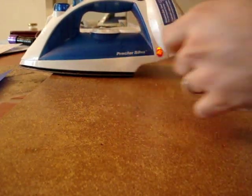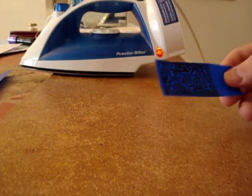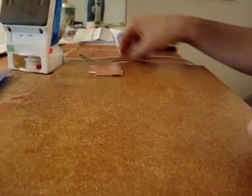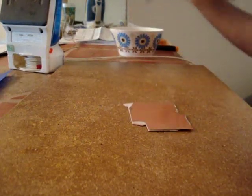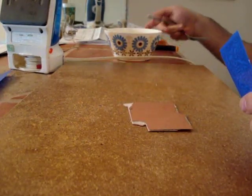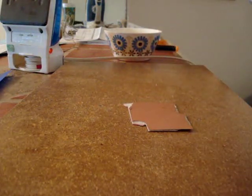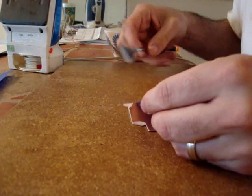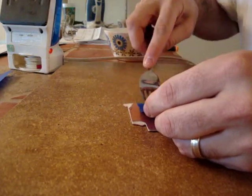Now I have my circuit — shiny side, dull side — circuit's printed on the dull side. Don't touch the copper plate, it's going to be hot. I use a fork. I also have a bowl of water here to cool it all off when I'm done. Now what I'm going to do — dull side down. It's already prepped pretty well, so I can just tap it on here.